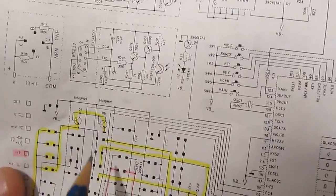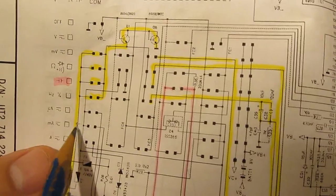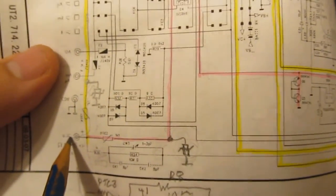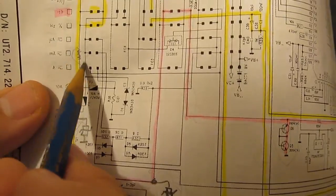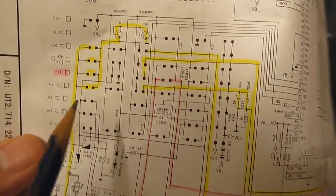I think what I'm going to do is replace these with a TVS, and then I'm going to put some kind of a series resistor in here. So again, when I hit this thing with a transient, it's going to go through this PTC, through this MOV, and back to ground. This will limit the amount of energy that's fed up and then through this leg into ground.